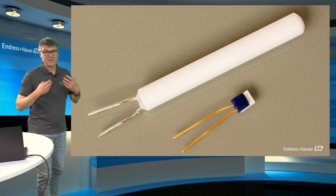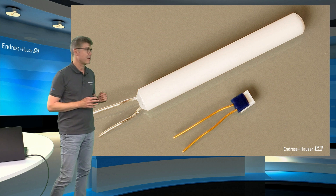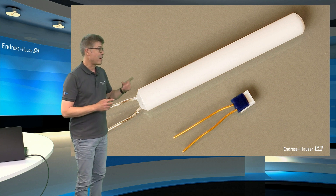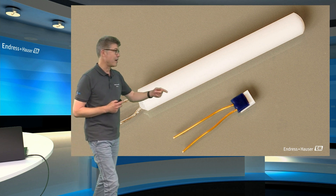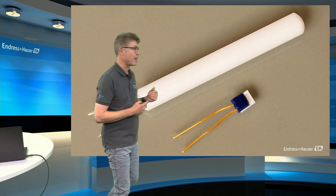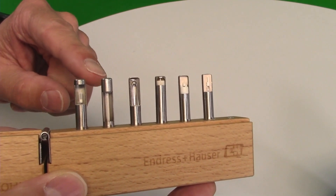This is how these sensors really look like. There are two general types. The first one, and the older one, is a wire wound sensor. That means there is a thin wire of platinum as a helix, protected by this ceramic body. It's connected here and the helix goes down again. The total length of a device like this is around half of an inch — 12 to 15 millimeters long.